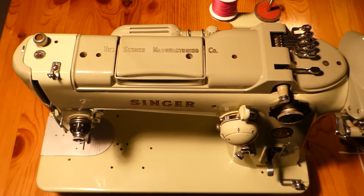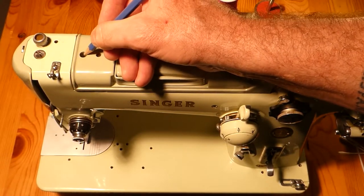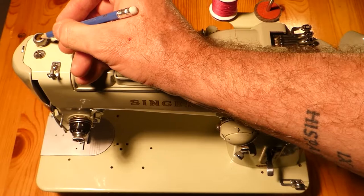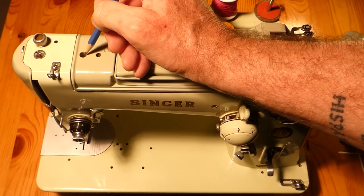Alright, moving on. We'll start up top here. Here is one of the oil holes right there. There is another one here and then one here. There's a screw hole, another oil hole, a screw hole, an oil hole. The top of these holes has a piece of cork, and what those porous things are for is you put a drop or two of oil on that cork and it allows the oil to soak through slowly — it doesn't all just run right down inside right away. We are going to do the screw holes because once we pull the screws out, they have to be oiled anyway.